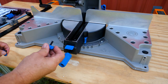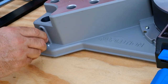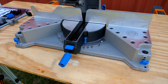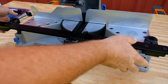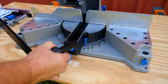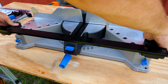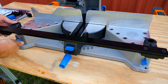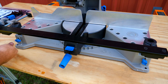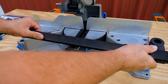These two thumb screws here with springs on them go right here in this lower hole, and over here as well — that's so we can add different clamps and guide bars. These upper ones have little detent ball bearings inside that are spring-loaded and lock onto different grooves. Based on the height you want, you can set those and then lock them down with the thumb screws to lock into place. If you want it back out, just loosen those, pull it out, and you're good to go.